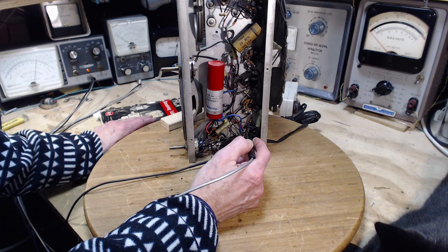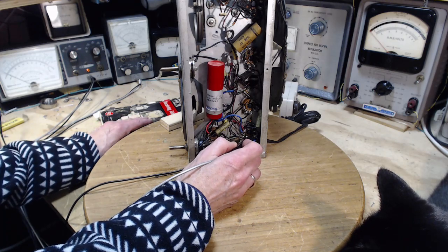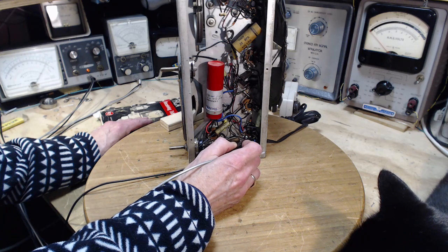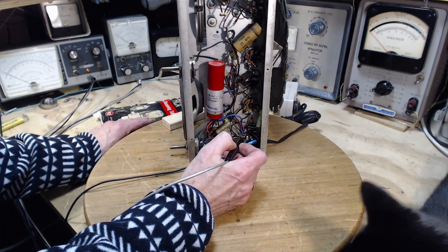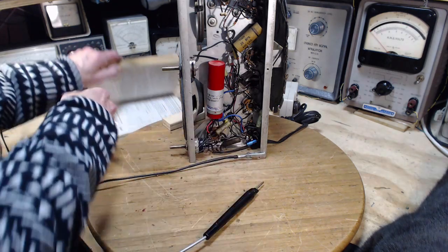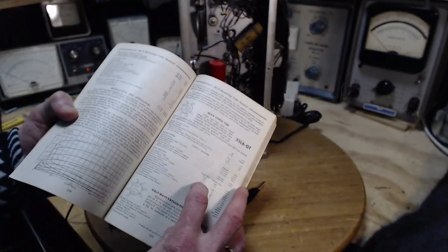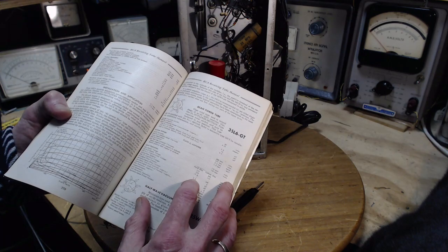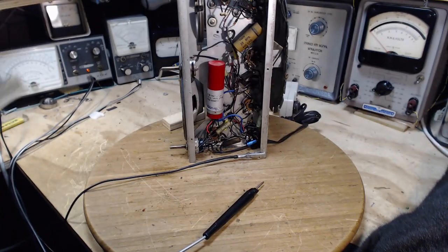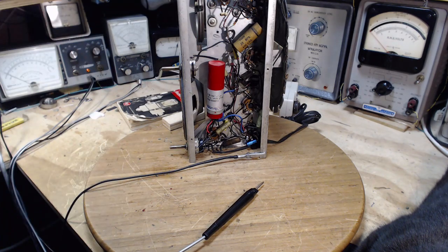So we really would want to know the voltage relative to the cathode. The cathode measures, I'm going to guess, 3 or 4 volts difference, I'd say. So that makes the grid 4 volts negative. What kind of grid bias are we looking for here? Sometimes it won't say in these things. Under fixed bias, minus 7 volts. So over to minus 3, 4. I don't know, it's all kind of curious. I don't expect to find little positive voltages there.